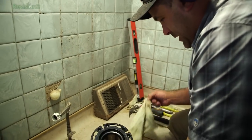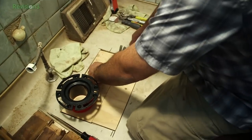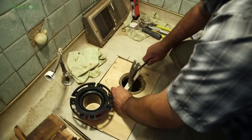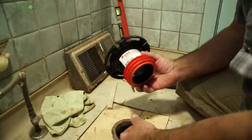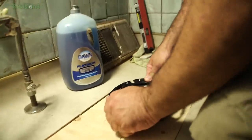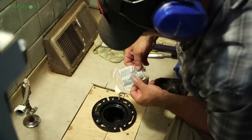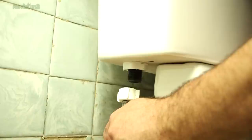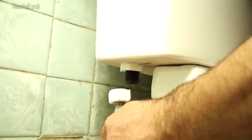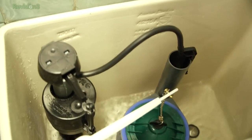The good thing is that we have new flooring for the entire bathroom coming in as part of a bathroom remodel in the near future, which means as hideous as this looks, it is a temporary situation. What we have here, outside of our crazy lead pipe, is a basically four-inch gasketed closet flange plugged into four-inch cast iron, PVC, or ABS pipe. Houses are supposed to have these already, which would explain why the old toilet was a little wiggly. Once we had all that sorted, it was just like any other toilet install. One last hiccup: the old flexible water line connector was 12 inches long — not long enough to reach the new tank — so we got a new 20-inch one, since the local big box store only had 12 and 20 inch.